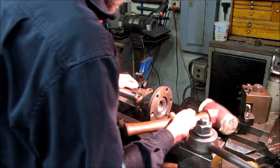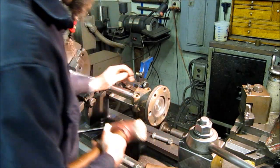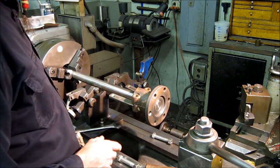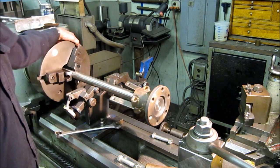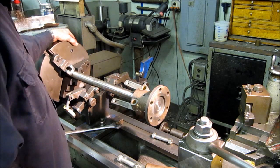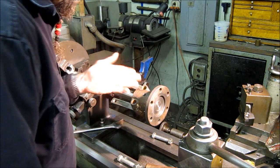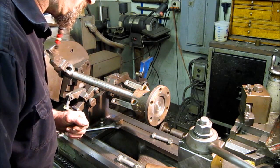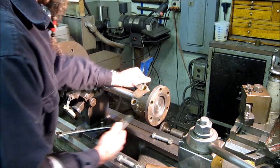Soft face mallet, bringing it in flush. Most couplings sit flush at that recessed area. Some of them protrude in about 3/16 of an inch because of the nut or system that is retaining the coupling on the transmission. I give it an eyeball down the dimple hole, release the wedges.